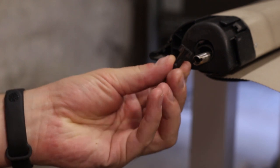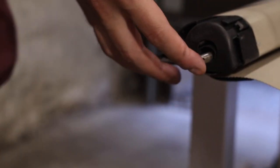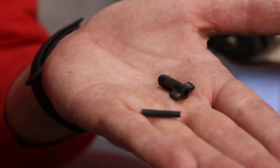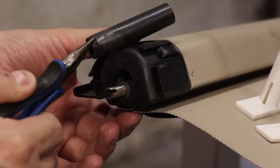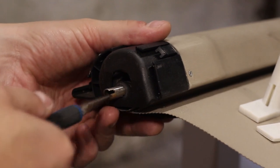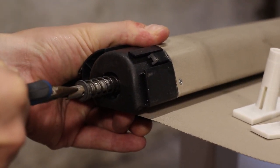Now lift the load cover and rotate it so the center part falls out. If it doesn't come out, don't worry, I got you covered. If it comes out, you can use this original part when you put it together. Now grab the rod with a plier and pull it out a bit. You have to see a spring, two washers, and a black tube. Get the black tube out and throw it away — the repair part will be too thick for it. After this, start to put it together.